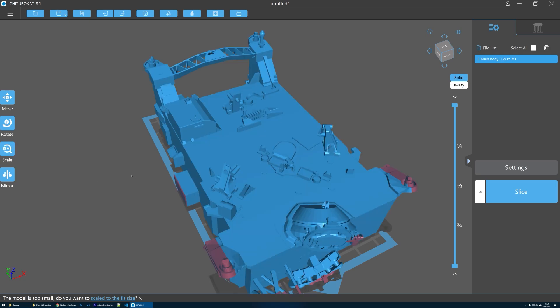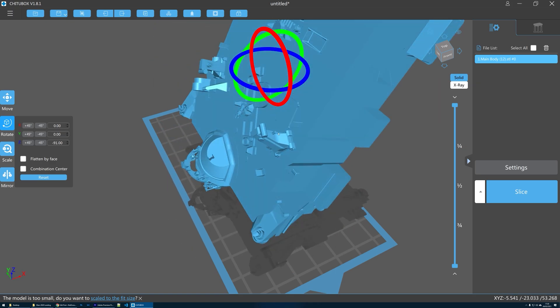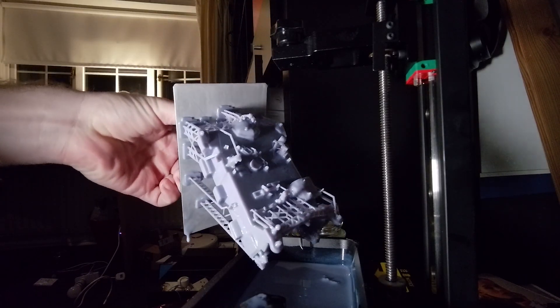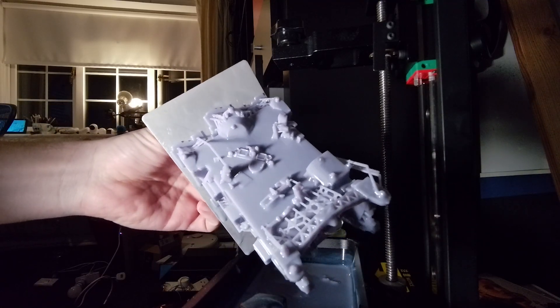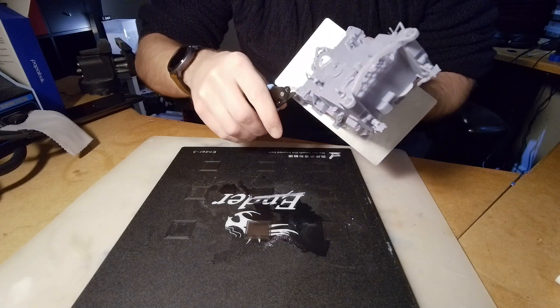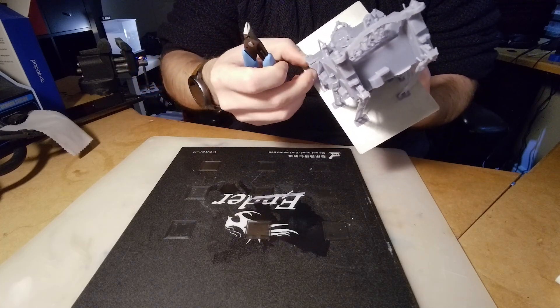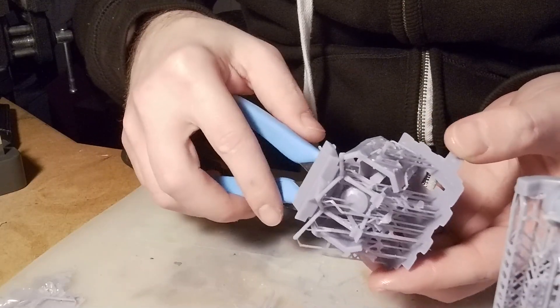After separating the parts, I picked the biggest one to be first on my printing list — that way I would know the total scale of my rover. It turns out the value itself was 4,950% of the original scale in Blender, and that's what I rolled with. This is where I started to learn more about supports and how important supports are in SLA printing, because thick supports would be very hard to remove, and I'd damage a couple of parts in the process. Thin or limited supports carry the risk of the print not emerging at all.